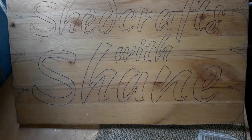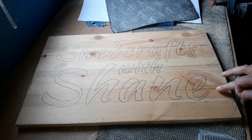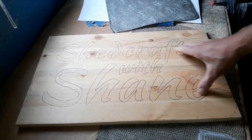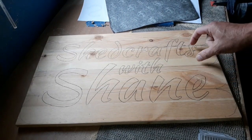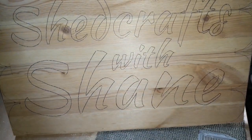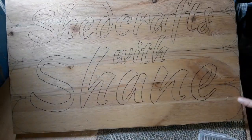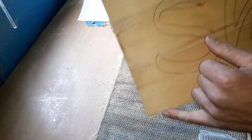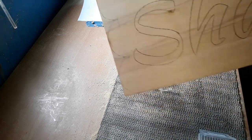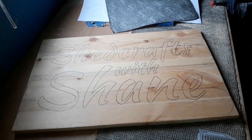This one today is quite a basic plaque. What I will do, just to make it a little bit different, is route out three lines down the middle the full length of the board to give us four little plank effects — like we've put them together like pallet wood. So it's one solid piece but it will look like it's made out of four pieces. Then we'll either round the edges off or put grooves in and give it a bit of a driftwood effect, but we'll know better once we've started routing.